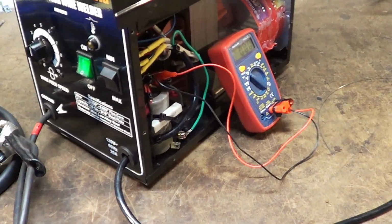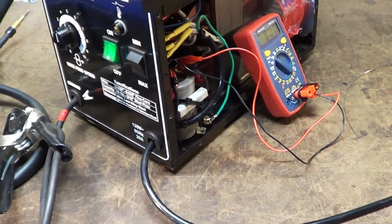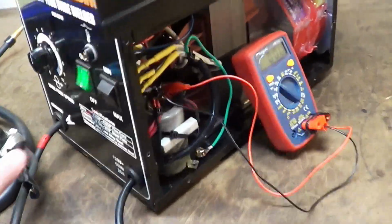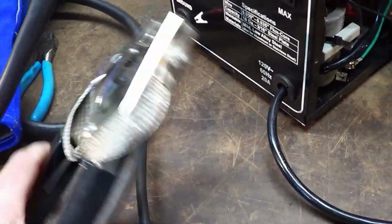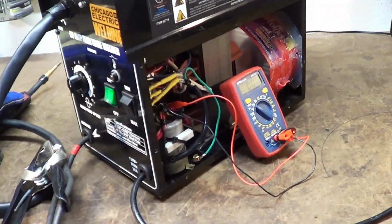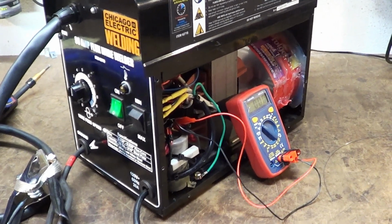Take your time, scrounge some components. It can be done with a rectifier, find some capacitors. If you throw capacitors in it, absolutely do a bleed resistor. Definitely worth upgrading this clamp. That's a $10 thing. You know, this is a $100 machine, maybe even $50 if you find one used, because people do sell them because they get frustrated with them.